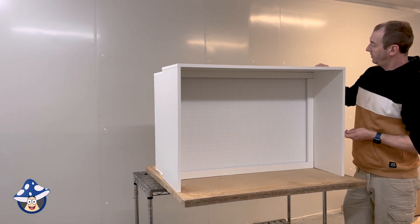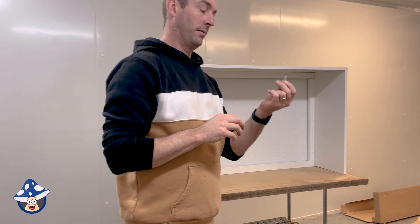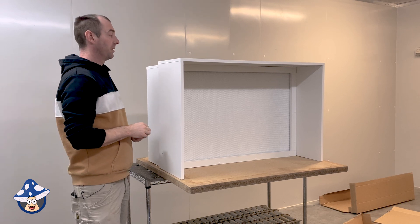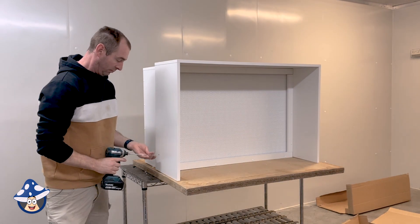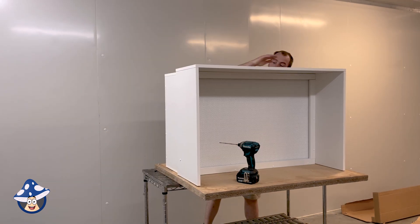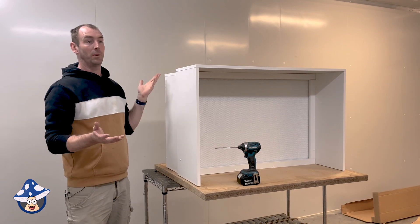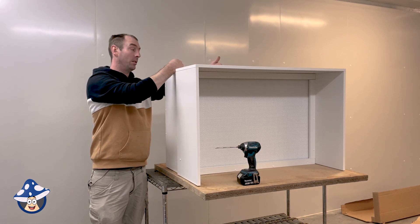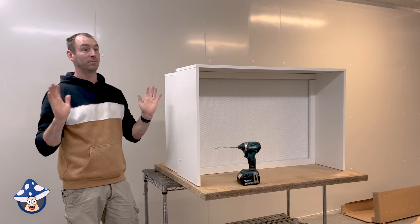Put on the little white caps again. We do have three shorter screws and they are for this front work area — should be one either side and one on the top. Just line up just back past the front caps on the top and screw them in, making sure it's nice and flat. Then your little white caps go on. We've got the front cover on — make sure you're very careful working with the filter so you don't poke any holes in it. All you have to do now is screw your fans on, line the fan up evenly over the hole on the box, screw it down, plug it in, turn it on and away you go. Thanks for watching — we'll see you next time.